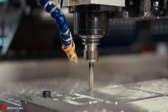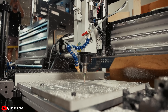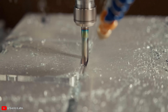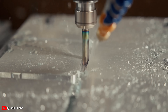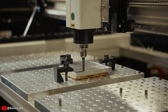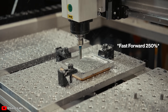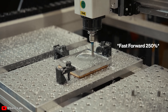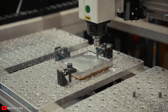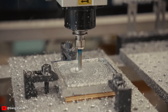The ATC has a manual tool change button where you can physically press a button and change out your ISO 20 tool holders, which accept ER20 collets — meaning tool shaft diameters up to half an inch. I'm curious whether they'll eventually make a more powerful version than 2.2 kilowatts, but it's a great place to start. The average air compressor needed will run around $300, and you'll also need an air dryer — one of the normal off-the-shelf $100 dryers works fine. It's clear they designed the ATC with their existing customers and their real-world constraints in mind.